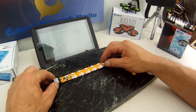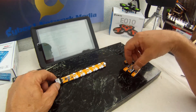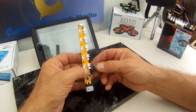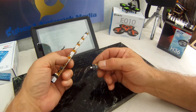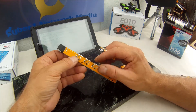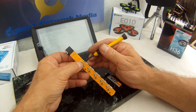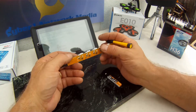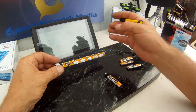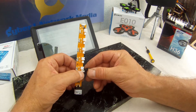There's significant risk of shorts, and shorts mean fire — which destroys equipment. The connectors are also weak; plugging in and out repeatedly bends them and you'll end up re-soldering them. You can actually see some erosion on a trace here due to overheating — it shorted out when I set it down on my bench and it landed on a small piece of metal. You could smell it. And the batteries alone have enough current to cause that kind of damage even when not plugged in.